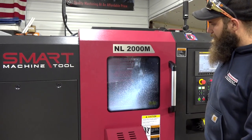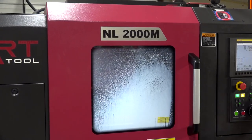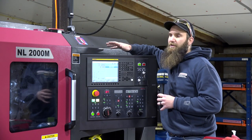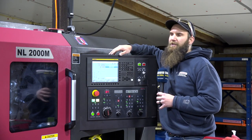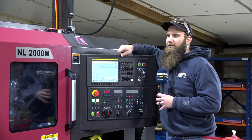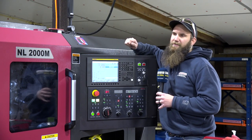When we first tooled this up for our projects, we went with all through-coolant supply because this machine has the high-pressure coolant system — 300 PSI coolant standard from the factory. That really lets you get the coolant right to the cutting tip, or with the ISCAR parting-off blade we can direct coolant right to the cutting edge, which is one of the big issues with a lot of old-school cutting blades.